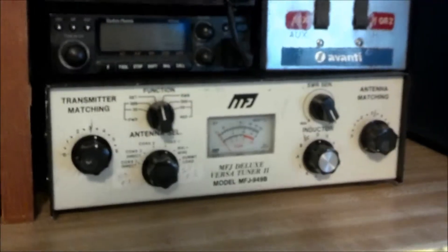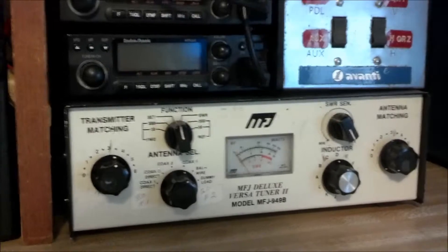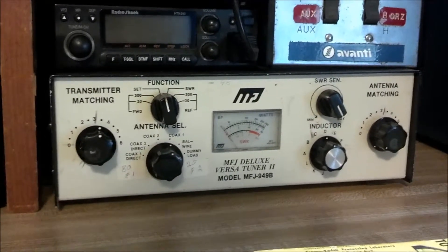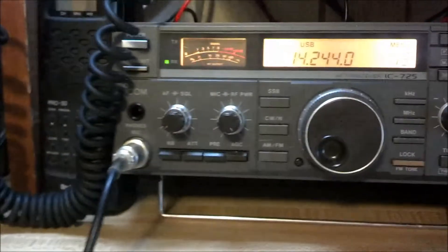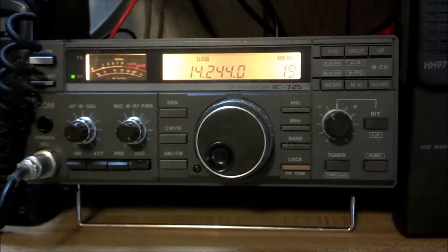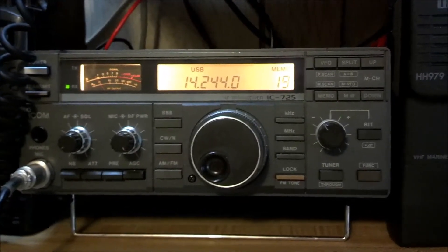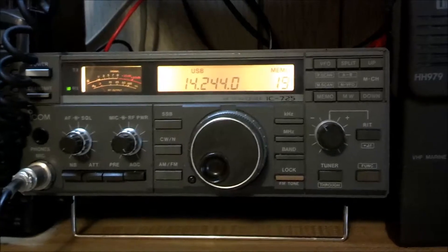I ran a 1-Delta, which means a single operator under commercial power, but tried to get contacts with a lot of guys around the country who were out on field using emergency power - so it was kind of fun. I had some difficulties tuning my antenna, so I thought I'd shoot a quick video. A lot of people out there know how to do this, but when I first got my transceiver and HF radio it was awfully difficult. There may be a few new hams out there who don't know how to tune their antenna. I've got a dipole up about 35 feet - that antenna is good from 10 meters all the way through 80 meters, which is 29 MHz all the way down through 3 MHz.